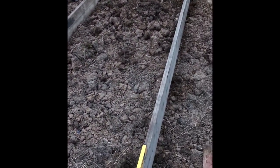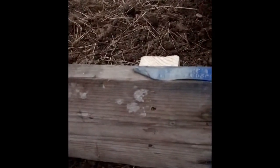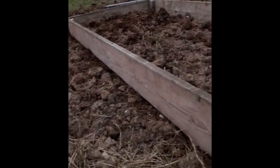My tip: get your two pegs in on that side, then check your measurements again just to make sure you haven't accidentally knocked the board out of alignment. One thing I should have mentioned earlier about screwing everything together — put your first screw in first, so as you go through doing your leveling it gives you some movement of the board. Then once everything is level, put the second screw in at the lower point to fix it all into place.